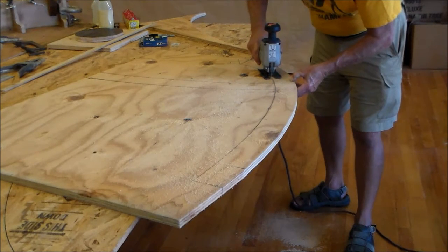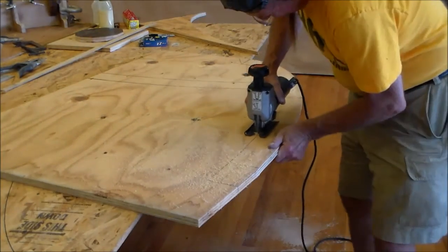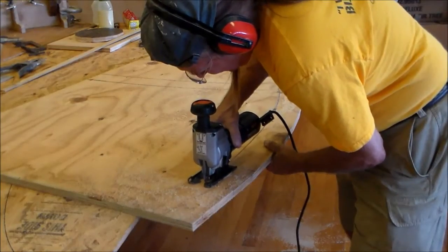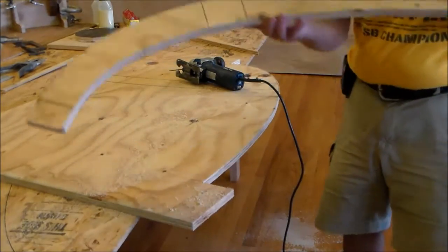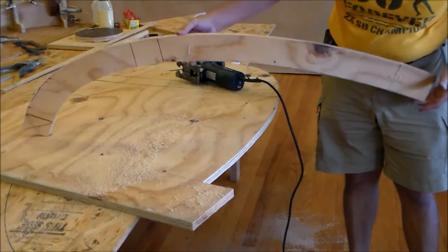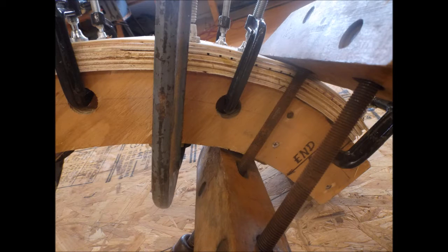Tracing a parabolic curve onto a three-quarter inch sheet of plywood, we cut two patterns out. Two by four blocks are cut to be used as spacers between these two patterns, and there are holes drilled between the two by four blocks that are used for gluing clamps. The holes have to be large enough to fit the end of your C-clamps.